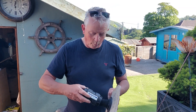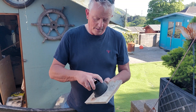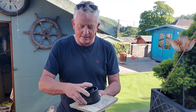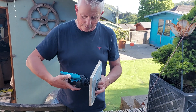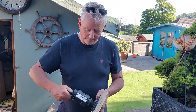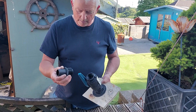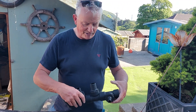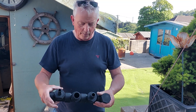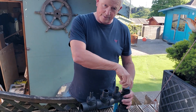Once you put that on using Sigaflex, you have the option of using the collar which supports it — and if you're in the USA or New Zealand, I understand it's almost compulsory by the associations out there. You can then have the options of an elbow going to a filter, or just a straightforward hose, but whatever you do make sure it's properly supported. They even do a matrix system, but one downfall I've noticed is that with all the threads it doesn't always quite line up, so be careful. There's also a strainer option — personally I would put a strainer in the system from the valve if you're going off to a matrix.